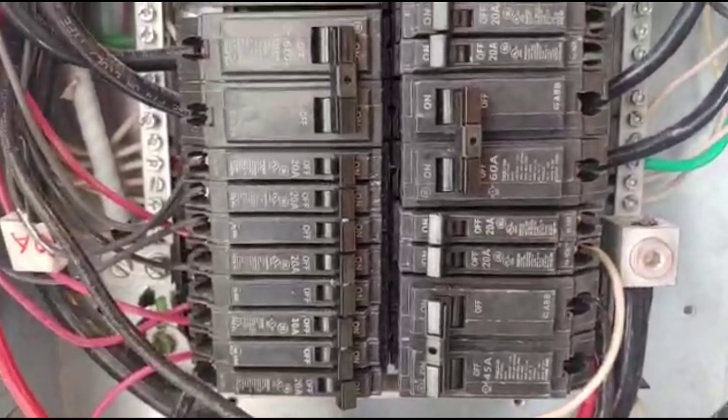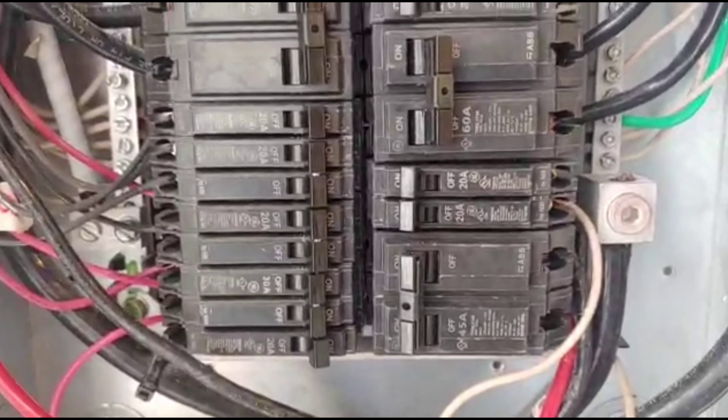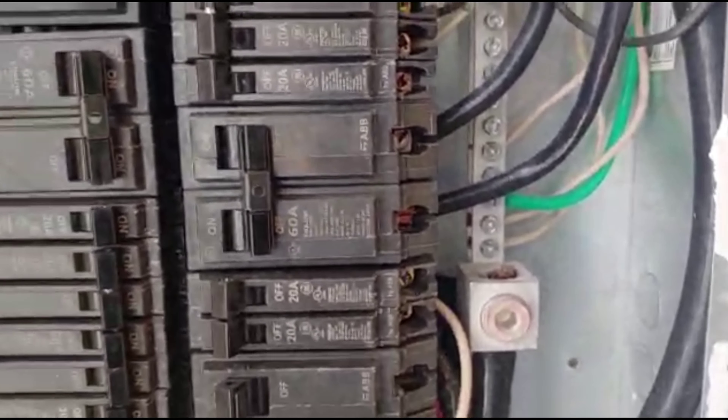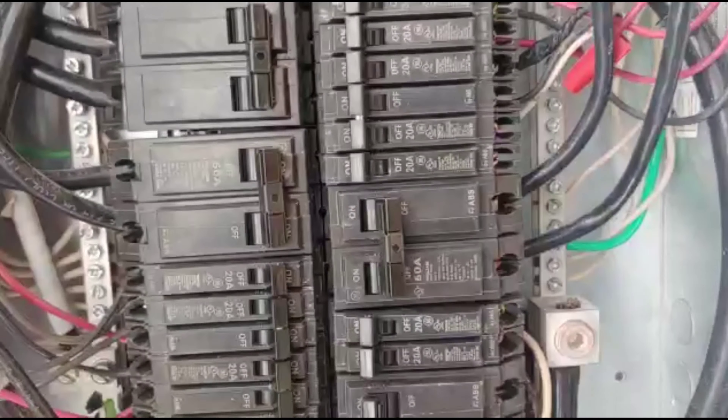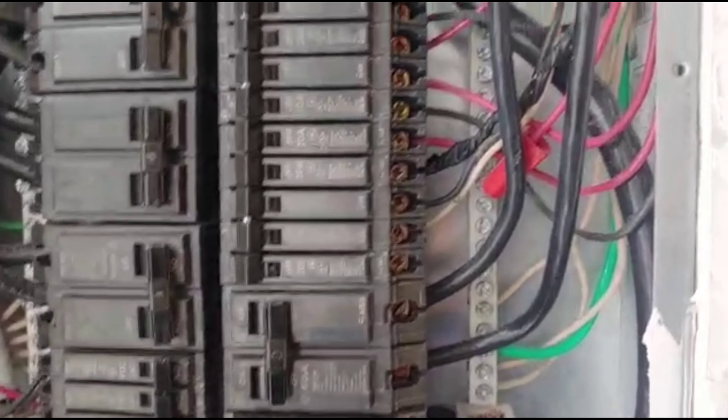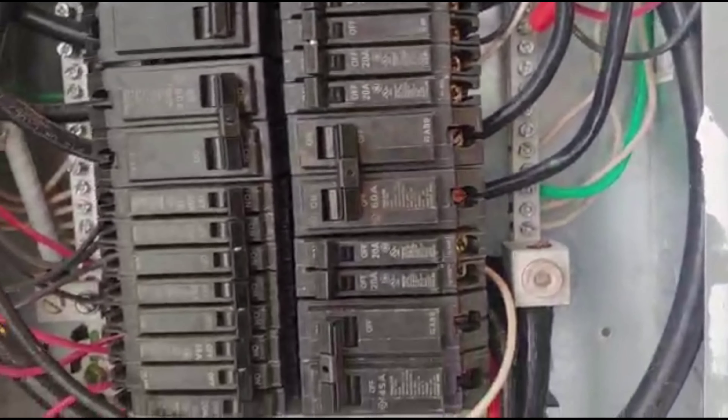Welcome back to my channel, this is Ingenious Giacomo. Today I was called to check on an air conditioning that wasn't working — it was tripping the breaker. I went on the roof, it's a 5-ton package unit. By the way, this breaker is way oversized; 40 amp will do because it doesn't have any heat. It's just a cool-only 5-ton package unit, R22 system — pretty old but still within guidelines.